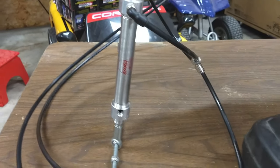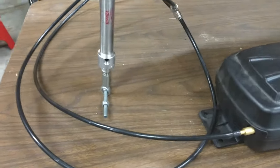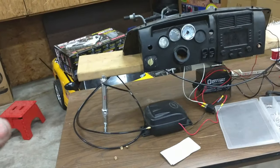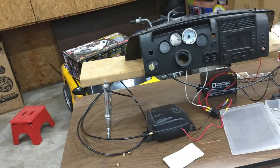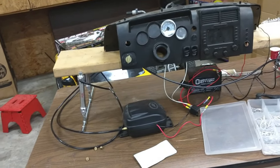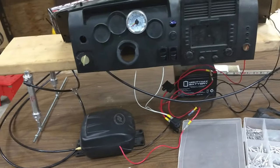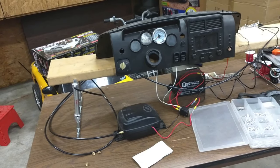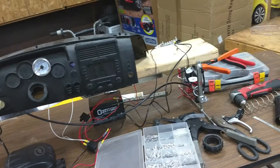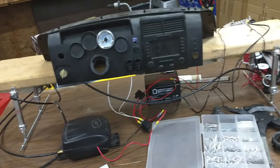Bimba air cylinder. And I have never used these before. And I put these caps in because I figured if I didn't, air was going to leak out. Well, it was causing an imbalance because there was some back pressure on the cylinder. So in a shock, you would call that pack. So they weren't raising and lowering equally. But we got it figured out. I have a good friend that's actually an automotive engineer that does this automation stuff. So he instantly knew what the problem was. Took the caps out, and this is the result, guys.